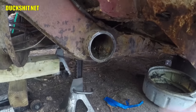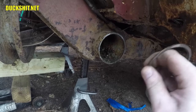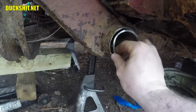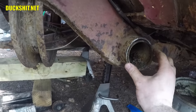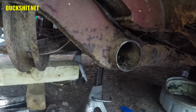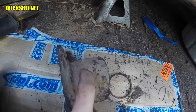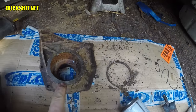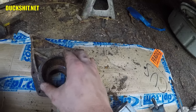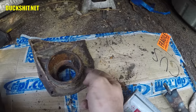It looks like I cut just a little bit too deep. I only wanted to go about two inches and this is part of the internal tube that holds the end casting to the actual pipe that is the torsion tube. So this is a piece that is inserted between them and then the weld goes all the way around - you can see that weld right about here, you can see some of the lumpy spots. That's about how much of this we're going to cut off, but the inner tube in here we're going to try not to cut into.